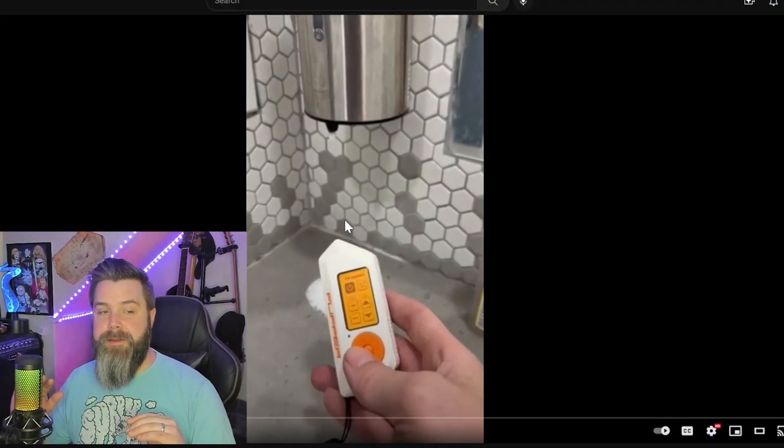So what's going on in this video is they're at a public restroom with soap dispensers where you put your hands underneath and the soap comes out. What's actually going on is there's an IR beam that beams down from the soap dispenser - if that beam is broken, the soap comes out. So what they're actually doing is using the universal remote to shoot their own IR beam at the soap dispenser, which is breaking the beam and making the soap dispenser go. It's a really cool application - this is legit, 100%, this is a real thing.